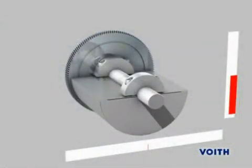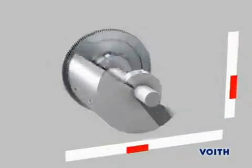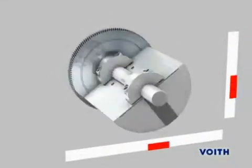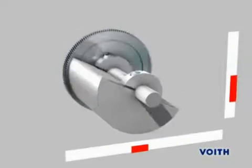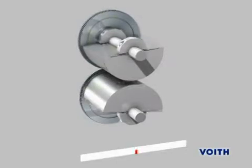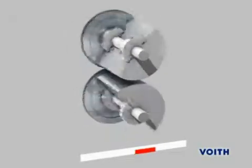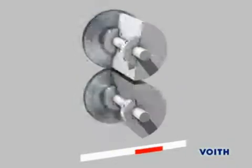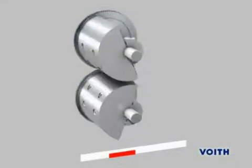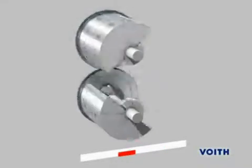The technical principle of the Duo Shake is based on centrifugal forces created by rotating unbalanced masses which are set into motion by electric motors. A single unbalanced mass would generate both horizontal and vertical movements as shown here. However, if a second mass is connected and set into counter-rotation, the vertical movements are eliminated by the cancelling of the vertical components of the centrifugal forces. Now the Duo Shake moves only in the direction of the breast roll axis.